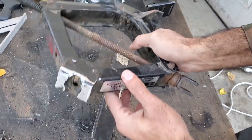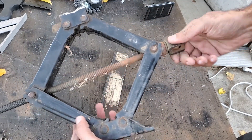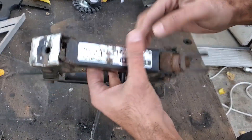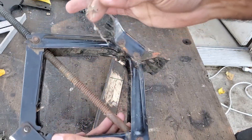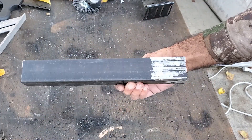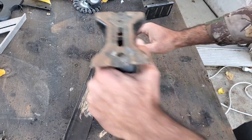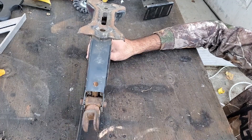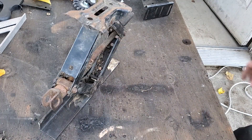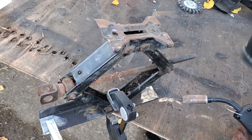For the mechanism of the vise, I used an old scissor jack I had laying around from a car I sold. If you don't have one laying around — which chances are you don't — you can pick these up for a couple bucks at any salvage yard, as they often take these out prior to parting out or crushing the cars. Once you get your scissor jack, go ahead and weld on the third 12-inch section of bed frame to the top of the jack.